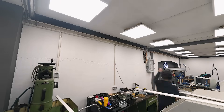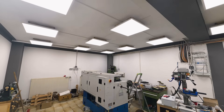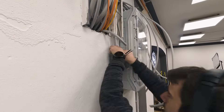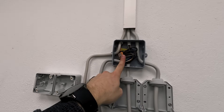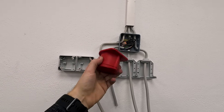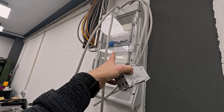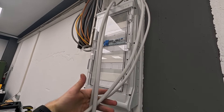It's also work I probably only have to do once, but especially the triple outlets were annoying because I had to feed three cables through them. After that I connected them together in the little distribution boxes with WAGOs. The wiring in the little distribution boxes is done. The actual wiring of the outlets and the wiring to the circuit breakers inside here I will have done professionally — I just left the cables long enough as I was told.